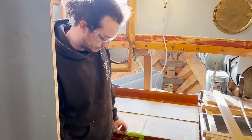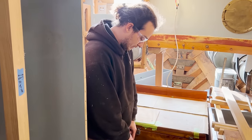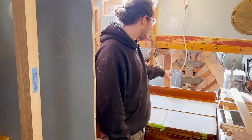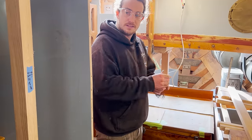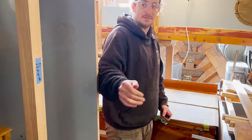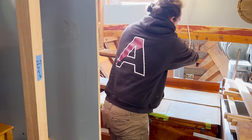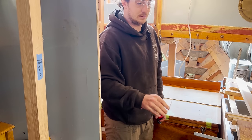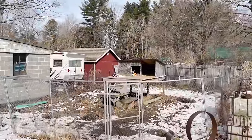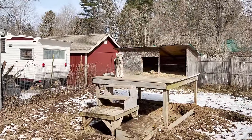So. And this is all to prevent the boat from sinking in case of like catastrophic? Well, no. So actually, this is the only catastrophic electric bilge pump. There's also a manual bilge pump, which is pretty significant volume for catastrophes. The main reason for the smaller bilge pumps is there's a bunch of dams in the boat where there are bronze frames that are impenetrable. So water drains down to the bilge and then stops at a dam in the forepeak. One back here, and then water leaks in through the prop shaft bearing and goes into a dam back there. So we have pumps that are mounted as low as possible just to keep that water. Yeah. And get that water out. Oh, that makes sense. What's the word, Akiva?